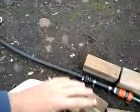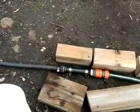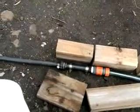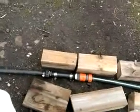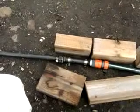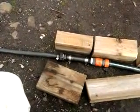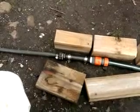So they put these things in to let the air out of the line, and they put them all basically at the end, and then it just hisses like hell, and then bang, slams shut. You can stand behind it and beside it and hear it hissing, and then all of a sudden it'll just sort of stop, and then bang, and all the water will start dripping out of the very last drip feeder without a problem. Now, that sounds great. Trouble is, they don't work unless they're under pressure.